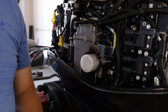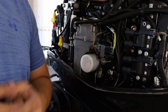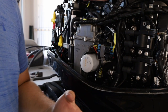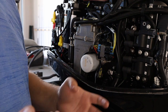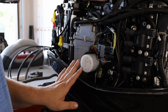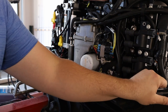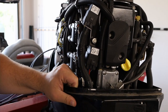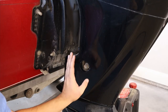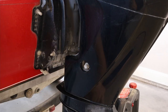Earlier when I was talking about the tools needed, I forgot a funnel — so you'll need a funnel as well. For those of you who have never changed the oil before, let me go over a few parts of the engine. If you're sitting driving the boat, everything I'm talking about is on the left side of the engine. Here we have the oil filter, the engine oil dipstick, and over here on the back of the engine this yellow cap is where you fill the oil.